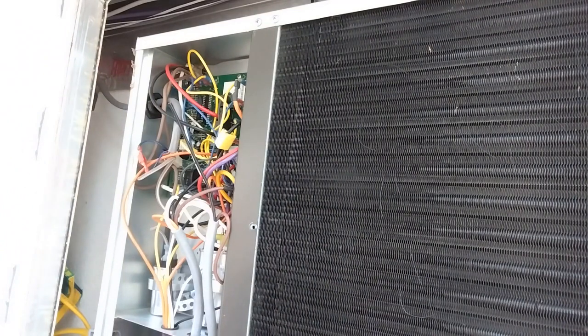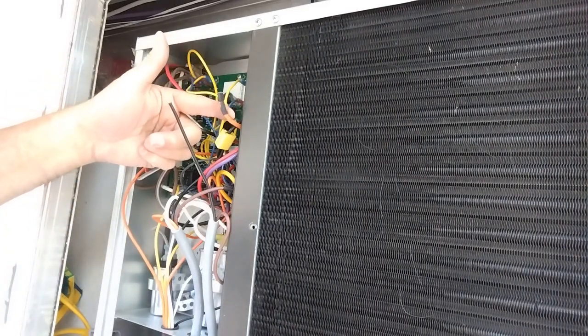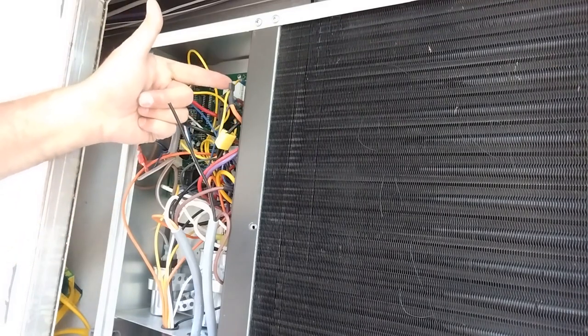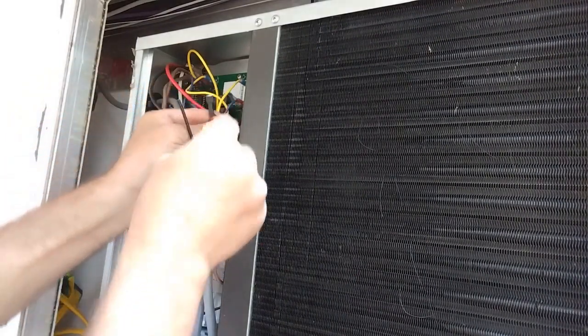Okay, I'm back. I had to pick this up right here. And it's the wrong one. That's not the one I was using. This one. Don't really like using these on AC power. They're really meant for DC. What it's doing, I think, since this is coming in after your relay, it's taking power as it comes in, going to the compressor, and it's charging that EasyStart. So we're going to go.